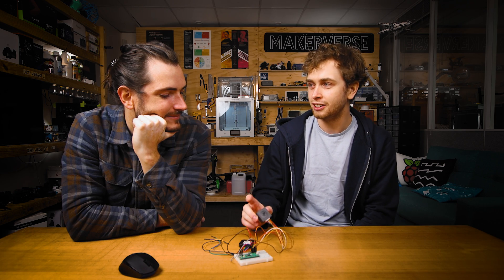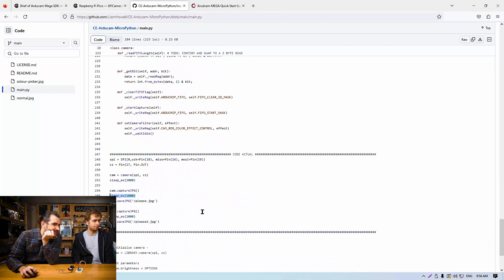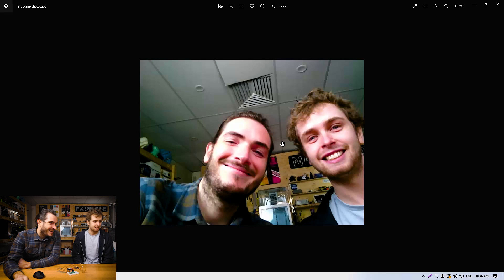This was the biggest gotcha: the camera has a white balance algorithm running inside it on its own dedicated IC — and it's undocumented, outside of a single delay in the example code. In the Arduino source there's just a 'delay_ms(500)' with no comment. That implies that after you've initialized the camera, the auto white balance needs to do its thing. If that delay is in place, the image actually looks just fine — the colors are correct and it doesn't look like Kermit the Frog. There it is!